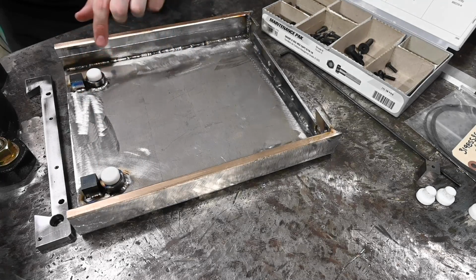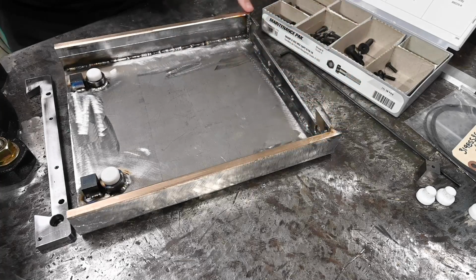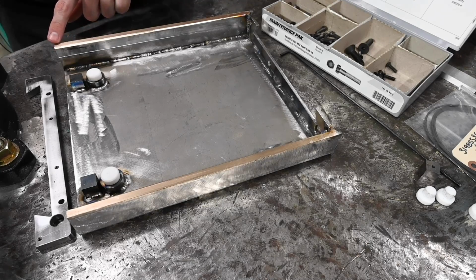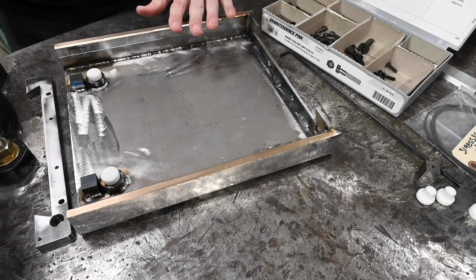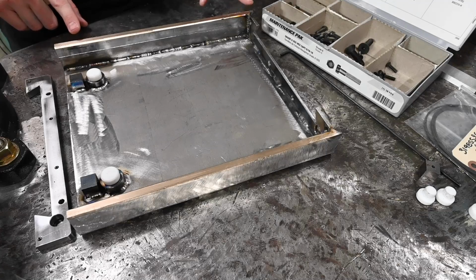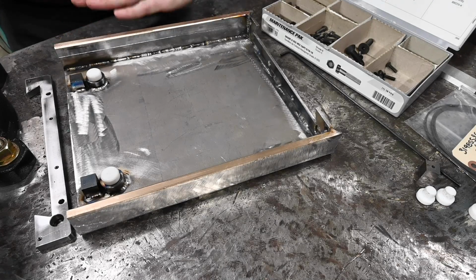Those are at a precise height to put this guard in the right position relative to the ways of the cross slide. And in order to figure that out, we had to leave this a little bit short. So there was a pretty hefty gap, anywhere from 60 to 90 thousandths, depending on where you measured. And what I did was built that up with silicon bronze with the TIG welder. And after we got this thing all built up, put it on the milling machine at an angle. So it took a very small shim, an 18 thousandths shim on one end, to cut more from this end and less from this end. So we have about a 0.09 degree angle, but it worked out so that this is straight parallel to the ways of the machine.